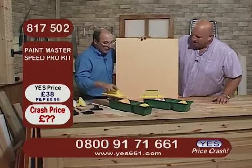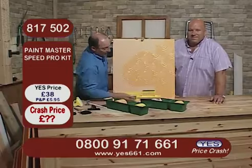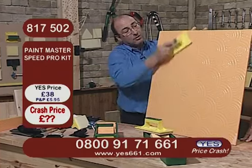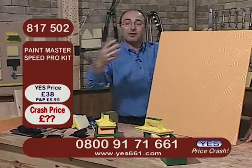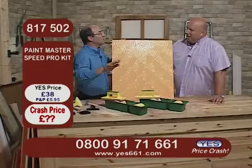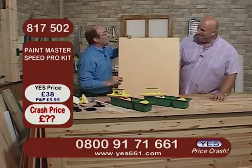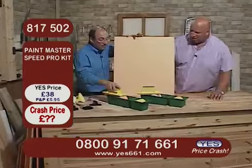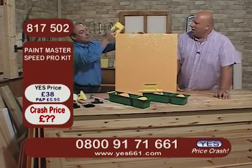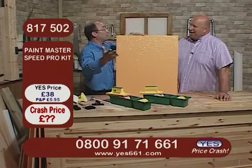All you do is you take the pad, you place it on the surface — it's fingertip control. Literally, fingertip control. Just move that pad around. About the paint — I'm just using ordinary emulsion paint. It comes with instructions, by the way. I've let the paint down — and when I say let it down, I mean I've added water, about 15 or 20% water, that's all. Then the paint flows much more easily, it goes onto the surface nice and simply, it doesn't drip or splash, and you get a fabulous coverage. More economical too, so you get the best results and the best economy as well.